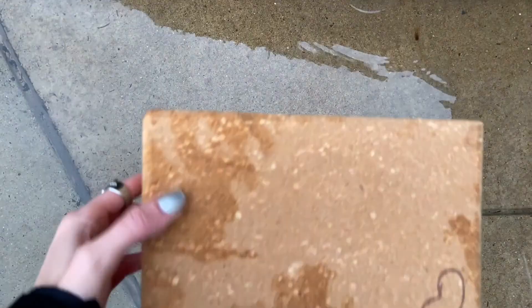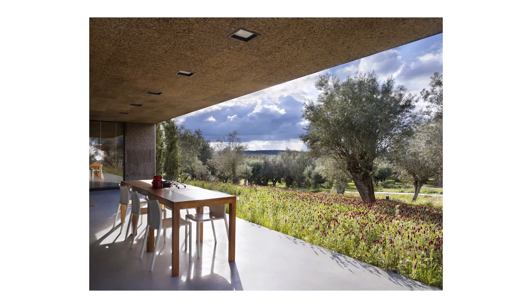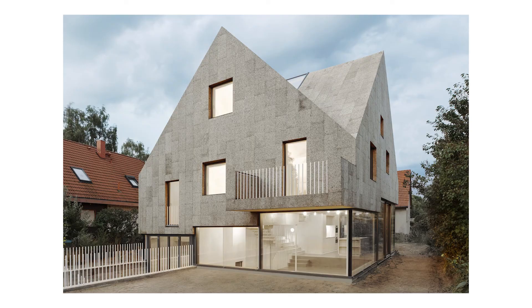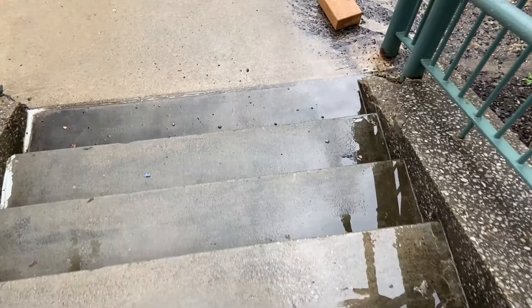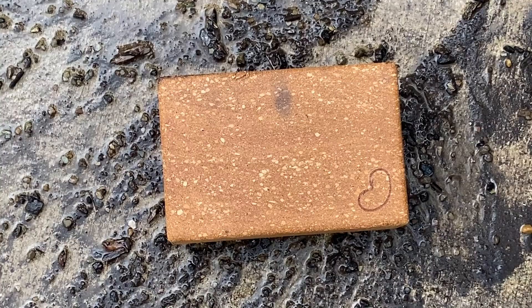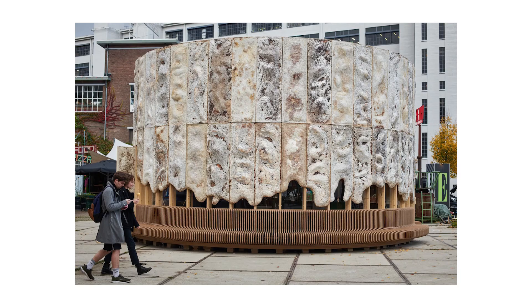Next up is the cork block. Cork has been used as underlayment in floors for many years, but recently has been gaining traction as an exterior surfacing material because of its great acoustic and thermal performance. Cork facades are breathable, resilient, and the natural wax-like texture protects it from rot and decomposition. Mycelium is 100% compostable and biodegradable. When dried and compacted into a brick, it becomes incredibly durable and is resistant to mold, water, and fire. While using mycelium as a building material is a great upcycling of agricultural waste, it requires a lot of care and maintenance.